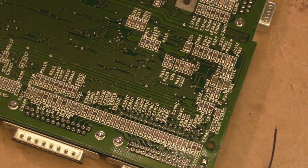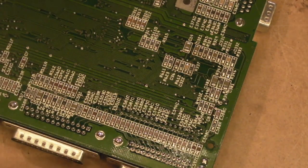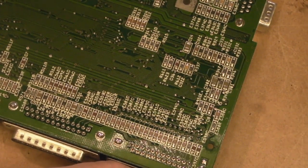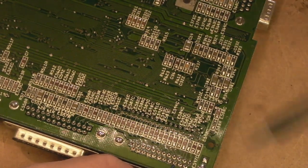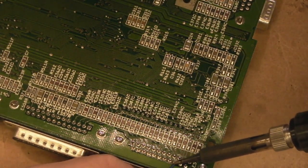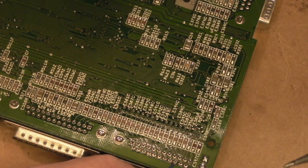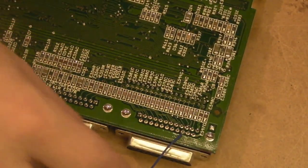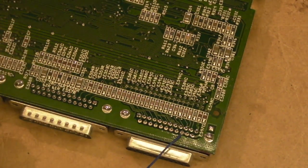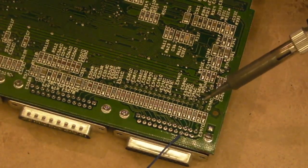That's soldered in. So basically our first wire — we want to solder it onto the third pin from this end of the disk drive connector. That's pin three in, which is that pin there. There we go, that's connected onto the third pin. And the next wire needs to connect onto the sixth pin along from this end, on the second row back from the disk drive connector.